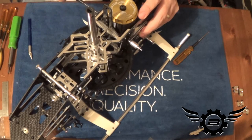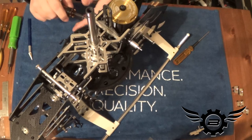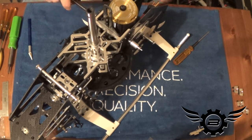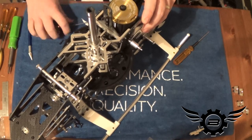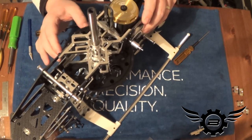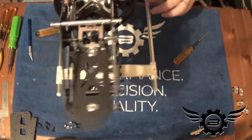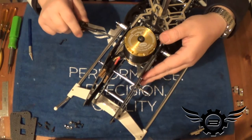Once it's feeling good, I tighten one of the bolts and check it again to make sure nothing has changed. Then I tighten maybe the two bolts on the pinion support bearing on this side, check again to make sure things aren't moving as they snug up. Feeling good — now I'm going to rotate the helicopter and do the same process on this side, check the mesh.